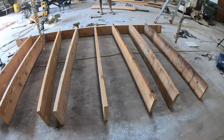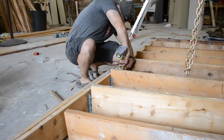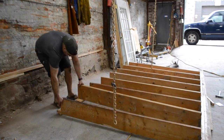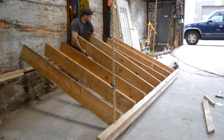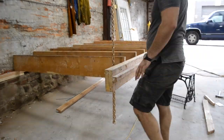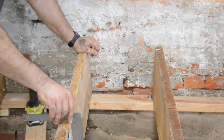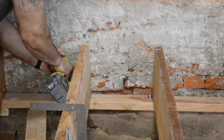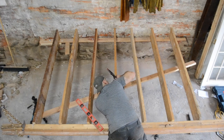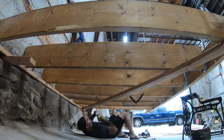I'm just laying my joists into place. They're 16 inches on center and I'm putting them in some joist hangers. Right now I'm just attaching them in place and I'm going to put some more fasteners in later. I used a long 2x4 to pick up all the loose ends and pull it over as a unit, and rest them on their bottom plate. I'm using my Singer base for the Singer 29K that I'm restoring — video out probably next week. Just getting everything plumbed up, squared up, and I'm toenailing those into place. Now this diagonal member will keep the whole system from racking while I install everything, and adds a little bit of strength to the system.